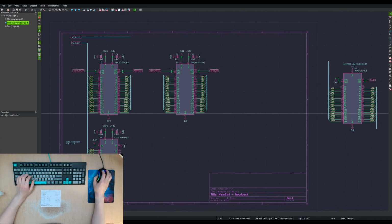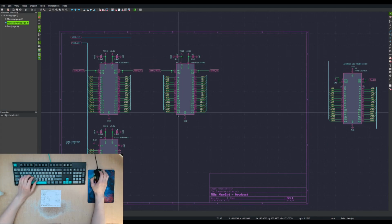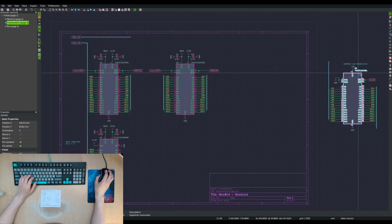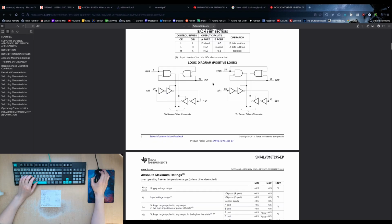This is like if we want to use the single voltage supply transceivers instead, which I was saying earlier. I believe the pinout is the same between the AVT and the ALVC. And the ALVC is converting, so it will convert our 5-volt bus voltage into our 3.3 volt memory chip voltage, or less than that if we wanted to do a lower voltage. I believe it's good into like the 1 point something volts. Maybe I'm completely wrong. Should we get lost in this?